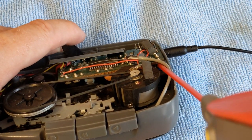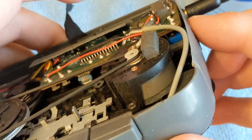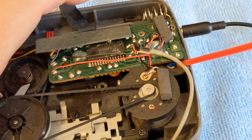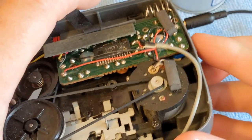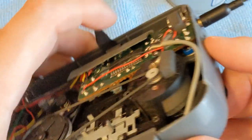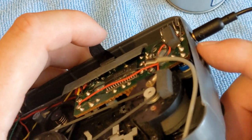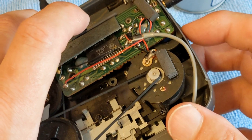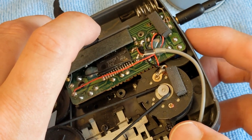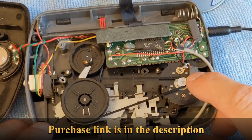I might have to cut the audio because my daughter's just arrived - although she has been on my channel. I think I've got some contact cleaner in there. It's like IPA - you just plug it in and move up and down. I can actually feel the difference on that; it's not as scratchy as I'm spinning it around. That's good stuff. I've been doing this YouTube channel for four years and I've never used contact cleaner before. I can really feel the difference - it's a lot smoother to turn that volume control now.